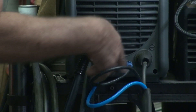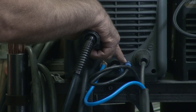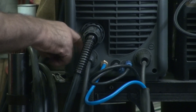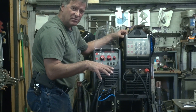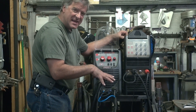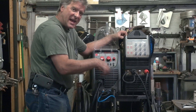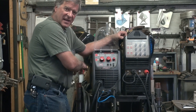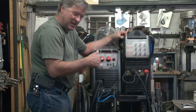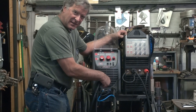You've already got your electrical connection for the controls on the TIG torch, and your gas line is already hooked up. If you're not going to use the TIG for a while, just disconnect all of that, coil it up, and hang it somewhere just to get it out of the way — so the weight isn't on that little connector or on your gas line.